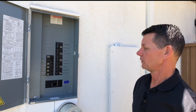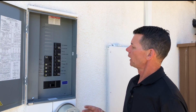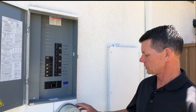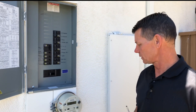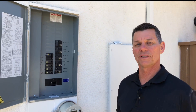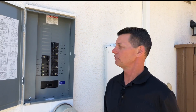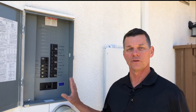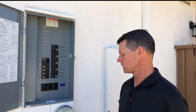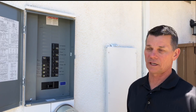I'm Greg Mahoney with Building Code Education, and this is the second in a series of inspection videos. Today we're looking at a residential electrical panel. We're going to treat it as if it were a change-out. The most important thing when looking at a panel is safety — you want to be aware of whether or not the panel is energized, and you shouldn't assume that just because the meter is not set that it's not energized.